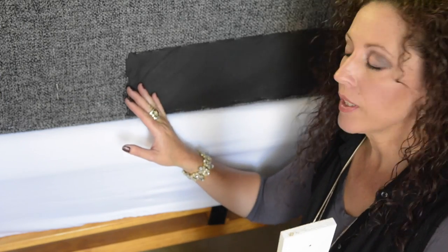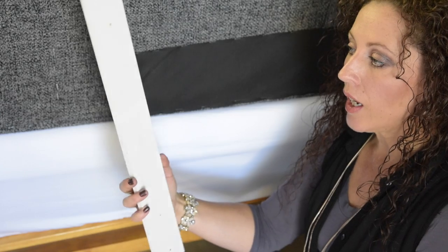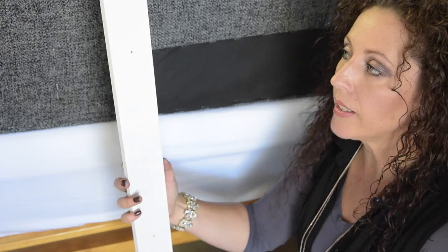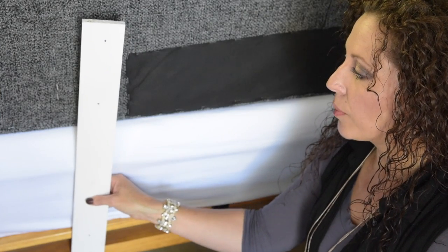So for you to install your headboard, put your headboard onto your mattress — that would be the easiest way — so that you can see where you're going to screw your little plank on. I just use ordinary moulding covered in paint, or you can paint your own one. You can use pine; it doesn't matter. Pre-drill your holes, and for your everyday bed that is a base covered in fabric, they have a strip of wood running across on the inside at the top as well as on the bottom. Just find where that piece of wood is, mark it on your piece of plank, and that's where you're going to screw it in. Pre-drill your holes so that it's easier to navigate the screws, and just use an ordinary chipboard screw to screw it in. So the idea is that this will be your support.